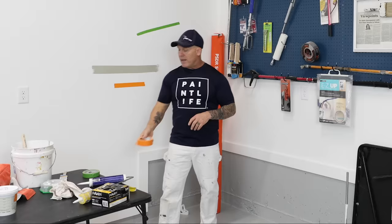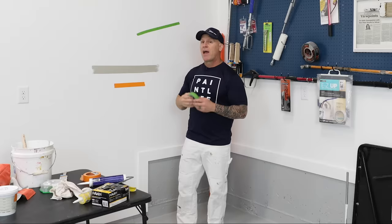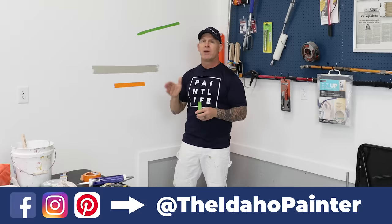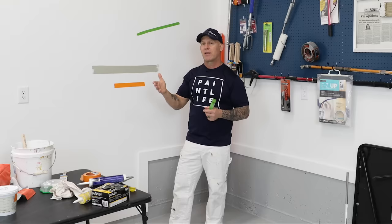Now if you get to rough surfaces — like this wall right here, which is a heavy orange peel texture — that's when we start getting concerned about paint bleeding underneath our tape. The heavier the textured wall, the more we move from just Frog Tape to Frog Tape with caulking. Frog Tape has a dust coating on the outside that swells instantly when paint touches it, so nothing can bleed underneath. Frog Tape works really well on lightly textured or smooth surfaces when brushing.